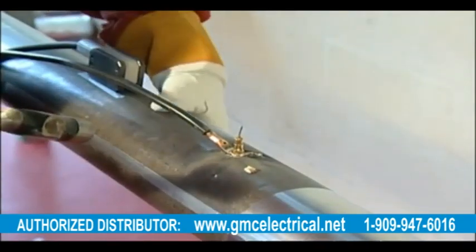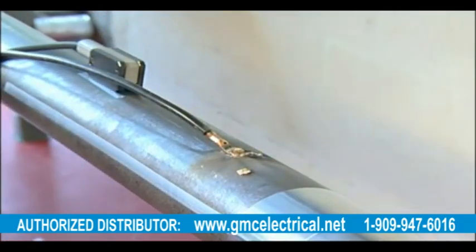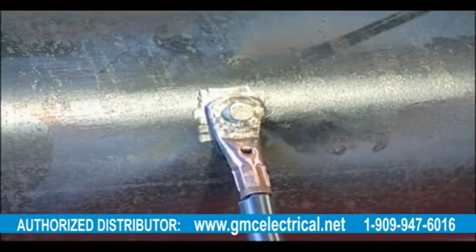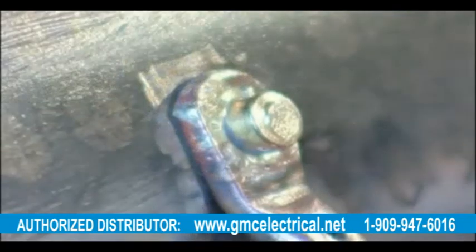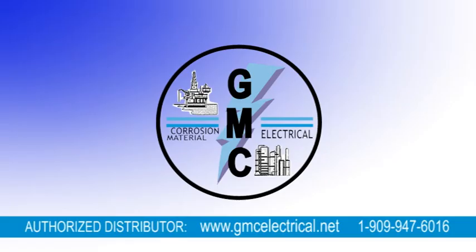Take a one and a half pound hammer and knock the remaining shank from the pin, or tap the unthreaded base of the threaded pin to test the connection. Wire brush and inspect. Threaded pins should have an even spread of solder material around their base. Direct pins should also have an even solder pool within the lug and around the lug base. Excess on either side would suggest that the gun was being held at the wrong angle during brazing. The remaining section of the pin after the shank is removed should not protrude from the surface of the lug by more than two millimetres. If the whole connection fails or is inadequate, do not attempt to reattach a connection in exactly the same location as excess damage may be caused to the substrate material. For further information contact your local supplier.